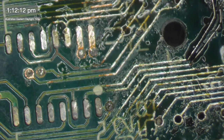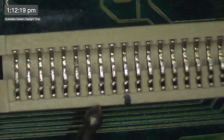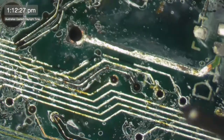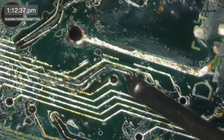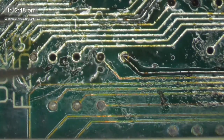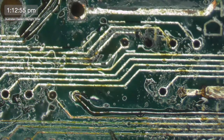Let's get a multimeter and we'll go to 1, 2, 3, 4, 5, 6, 7. And check. Nothing. So, yes, I'm going to have to do that one again. I'm going to take the trace off. Everyone, I want you to all come forward with insults for doing what I just did, which is clearly wrong. Nice, neat trace repair. Sure, why not? But I didn't give myself enough wire on the other side. And I do want to do this in one piece and not in pieces.